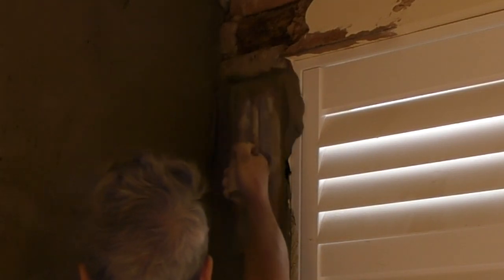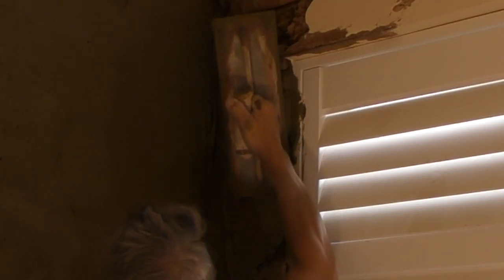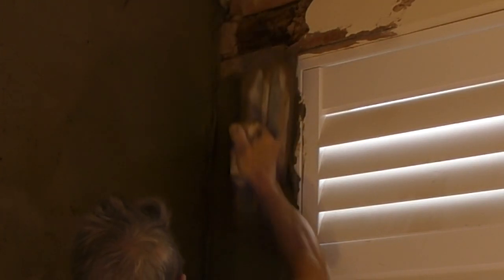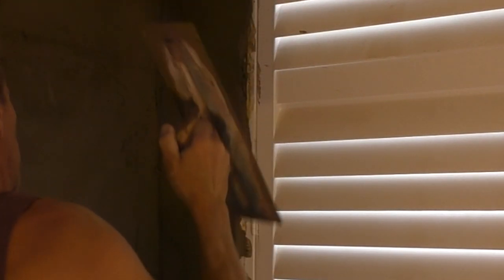That's just a reverse of what was doing at the lower end - using the toe of the trowel, putting the stuff on and coming down. You can see at this point that edge is just a rough old mess but there's nothing else you can do at this stage. So basically I'm building this part of the wall up so it's thick enough to give us our reveal back - basically the original size that it was - because the actual angle bead that was in there had completely gone rusty and was just a terrible mess.